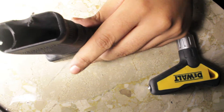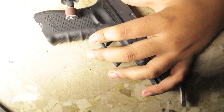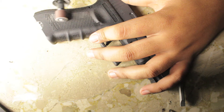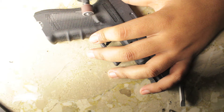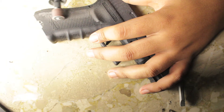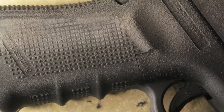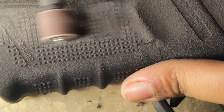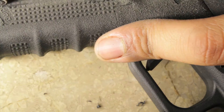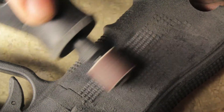Here you can see I'm also shaving off the bottom of the magwell. The reason is that when you eject your magazines, you can take your index finger and thumb and slide them along the bottom of the magwell to extract the magazine without dropping it. You get a better grip because parts of the magazine are visible and tangible — you can grab a piece of the magazine rather than just the base plate, making it easier to extract magazines.